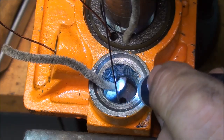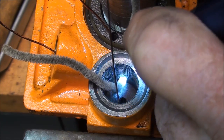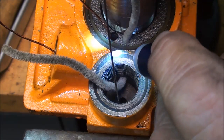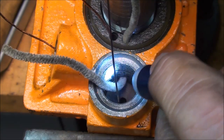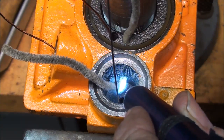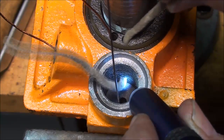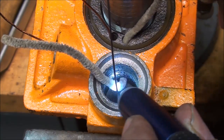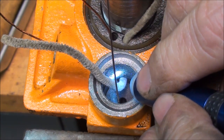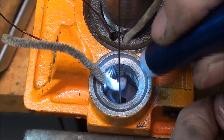From this view, the very bottom hole is where the high pressure oil is forced through that passage and into the cylinder. You can see the pipe cleaner moving. Where the pipe cleaner is going in, that little side hole is the passage where the low-pressure oil enters the pump so that it can be pressurized and then in turn forced into the cylinder.